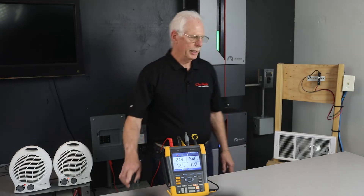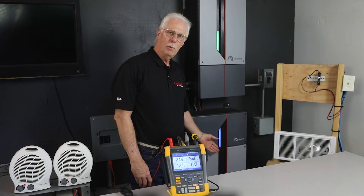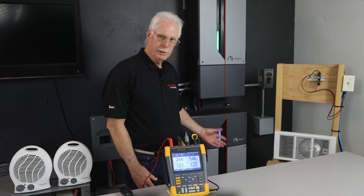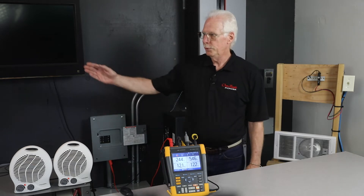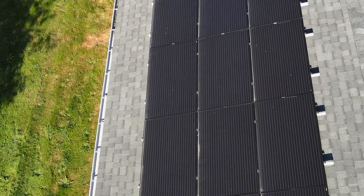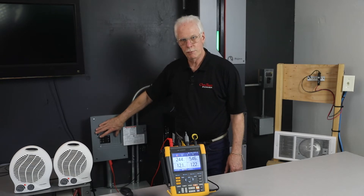So let's take a look at the setup. We have an 8,000 watt Mojave inverter and an 11.8 kilowatt hour lithium storage system as part of the total energy storage system. That is tied into this panel with the Mojave's output, which is AC coupled to an SMA 8,000 watt inverter that is being fed with a 7,000 watt solar array. The output of the SMA and the output of the Mojave are both tied together via this load panel.